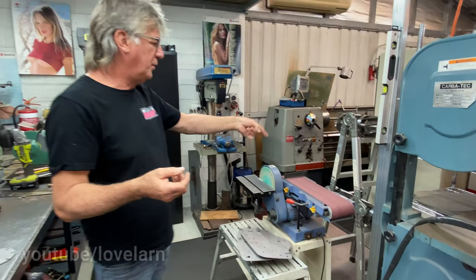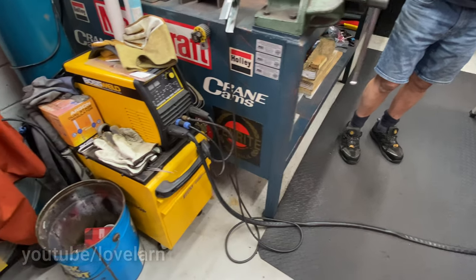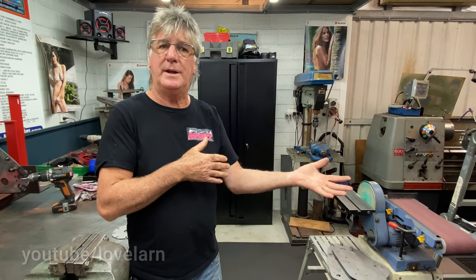But to weld those two reels there, I TIG weld, I don't MIG weld very much at all. They're all TIG welded, right? I can control the heat, that's the machine here. I've got infinite control over the machine, the length of time that the weld takes place to keep the heat away from the cutting edge of the blade, and a much stronger, neater, no weld spatter, absolutely ideal. However, much better for welding dissimilar metals as well, which you've got 4140 mild steel, then you've got a spring steel blade at 44 Rockwell hardness. So you're welding dissimilar metals.